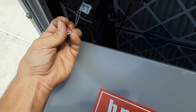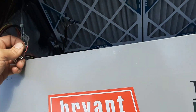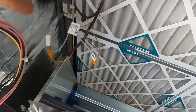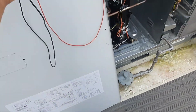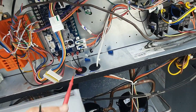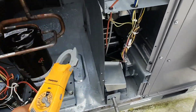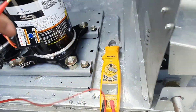I'll just get a wire, stick it in there, go check it and make sure, and then we should be able to cycle it on. But we need to ohm the compressor out first to make sure nothing's wrong with it. I dropped my wire, got my jumper - that should be good enough, it's hard to get in there. All right, that's closed.